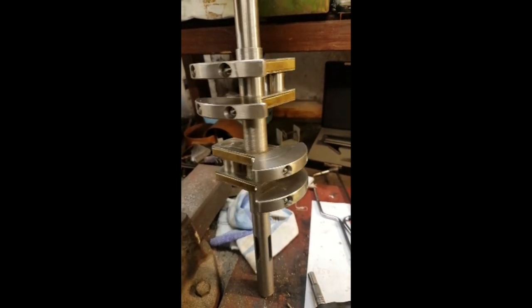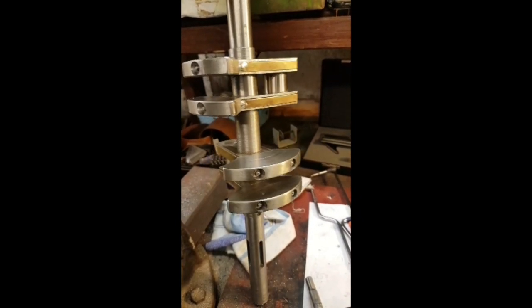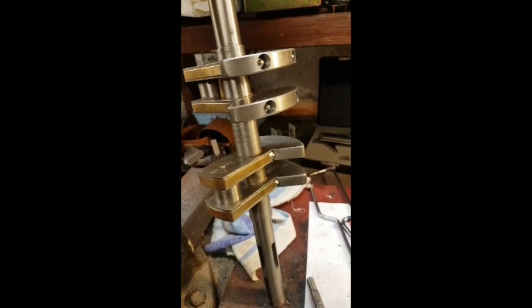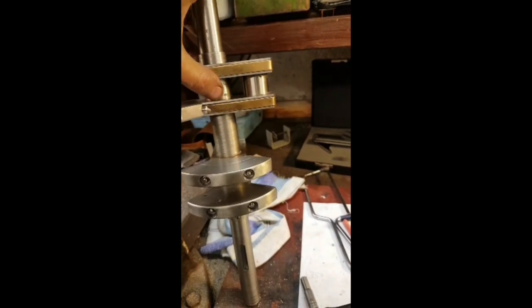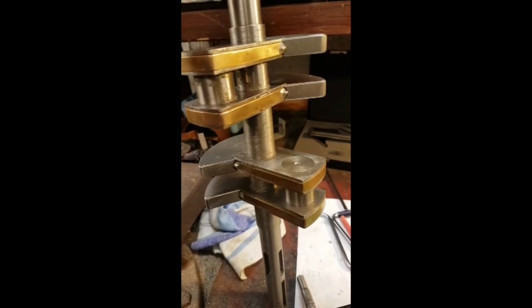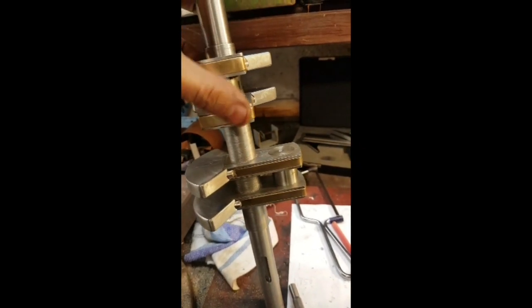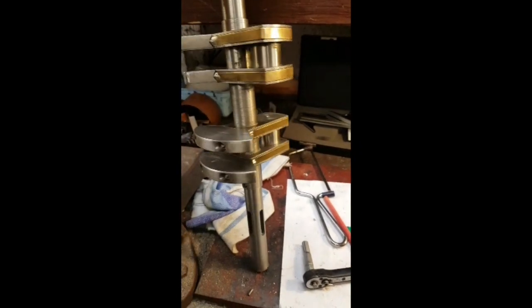So does anyone want to crank my shaft? Probably not. But as you can see the counterbores came out very nice. I've cut all the studs to length and just put nuts on lightly. Now the keen-eyed of you will notice that I haven't yet taken the centers out, which I am going to do promptly, and also I'm going to clean some of the knocks and notches up that have come on the brass. So I'm going to get on doing that while you go and have a cup of tea.